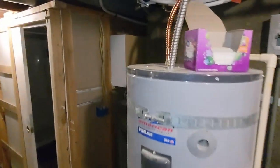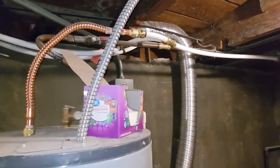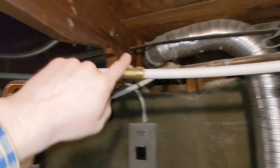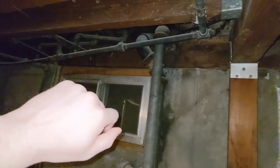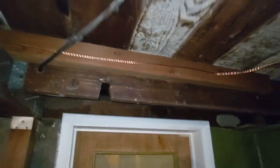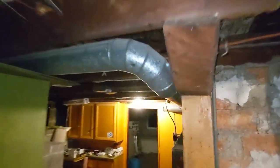So of course we're back down in the basement and right underneath here, we can see where that cold water line used to go. Maybe a hot water line too, if there was a sink in that bathroom, but some other super interesting things. One thing that plumbers, electricians, and general contractors will notice is that there are some serious chunks that were taken out of my floor joists here. That one might not be so bad, but what's weird is this side of the house — we have this cold water line right here that comes from the city. One fork goes to the water heater and one goes to some of the sinks. It really looks like this was capped at one point over here in the basement. We can see some big chunks, and someone came by later and sistered a two-by-four right there, but this one is really not great either.